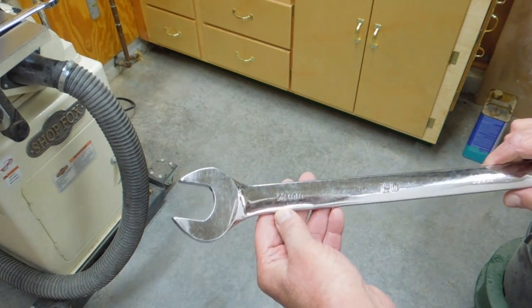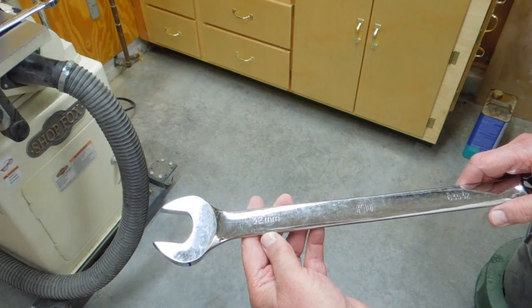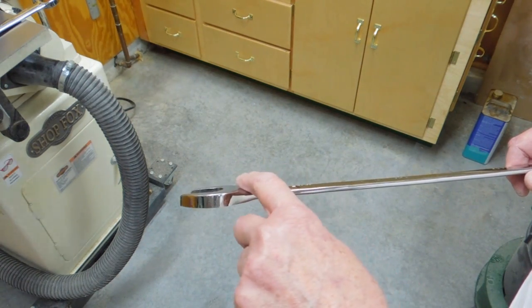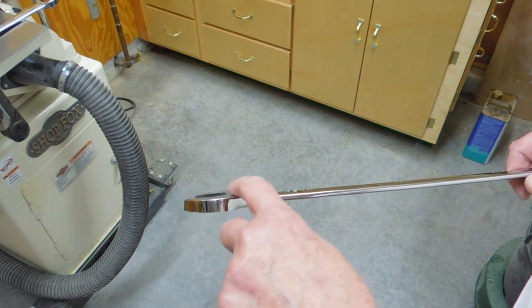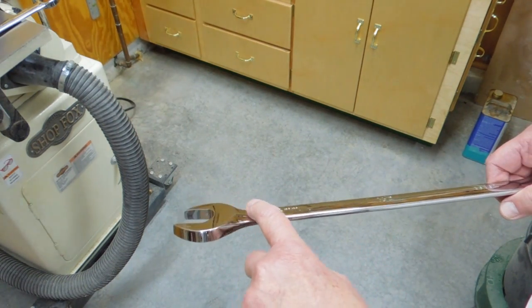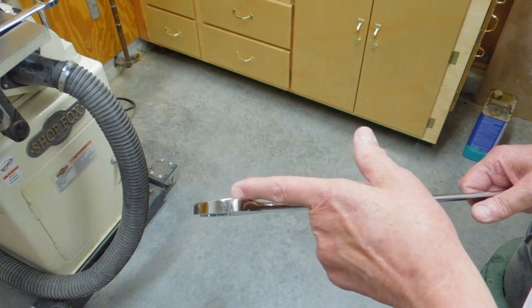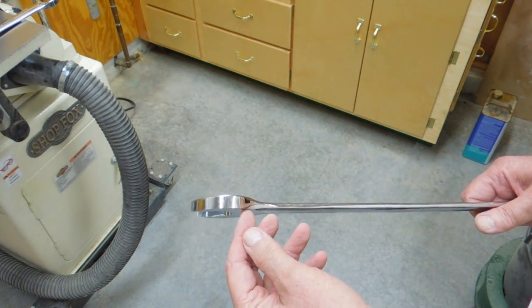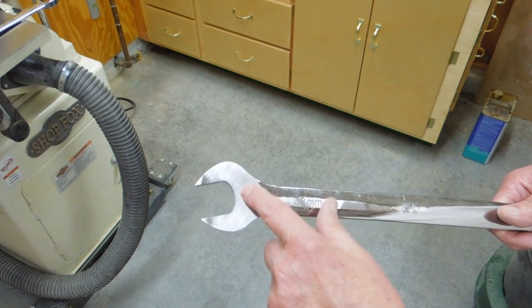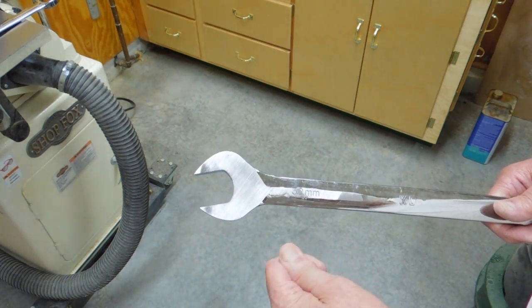This is a 32 millimeter. This is the one that fits down inside the machine on those double nuts. You can see there's a bit of a fillet right there that comes out to the flat of the wrench. We're going to want to grind this part of the wrench down until it's flush with the bar of the wrench. We want to keep these two surfaces parallel and flat, so we want to grind this part away and then lap away the rest of it.